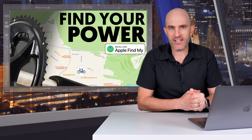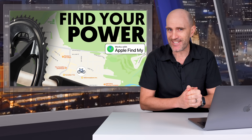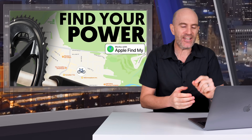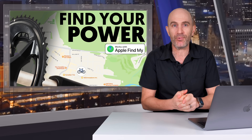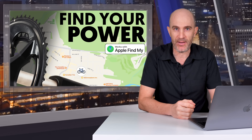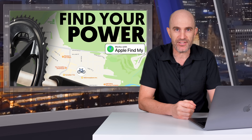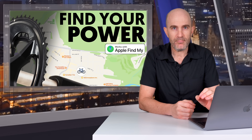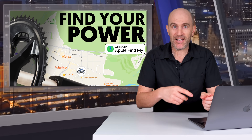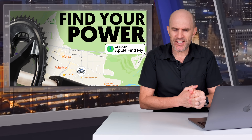Getting something like this certified with Apple requires a number of hoops to jump through, and as such there are some really interesting tech tidbits in the implementation. Starting off: the Find My beaconing mode on the power meter will only work and only be activated when the unit is asleep. Per Apple certification requirements, you can't be both active and beaconing at the same time. The timeout is around five minutes — meaning if you pull your bike up at a cafe or it's stationary for five minutes, it will start beaconing and its location will be reported back to the Find My network by anyone with an iDevice in range.